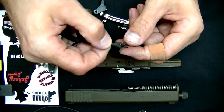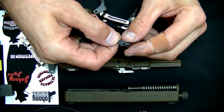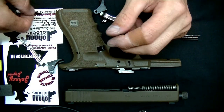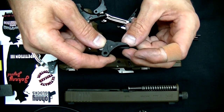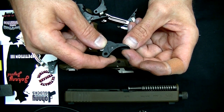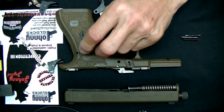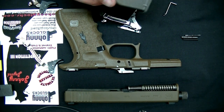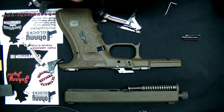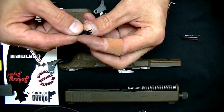I have a kind of proprietary way that I work on this leaf spring. By the time I'm done, the leaf spring is well extended. What that's doing is giving you much better reset of the trigger safety. That trigger safety — I know you've felt over time some Glocks that just lose that snap on the trigger safety coming back, and that's because this leaf spring is wearing out. So I do a couple things to it to really get it to stand out. This is one that I've worked on, and you can see this is quite a different angle than the stock one.